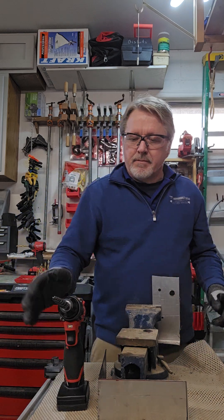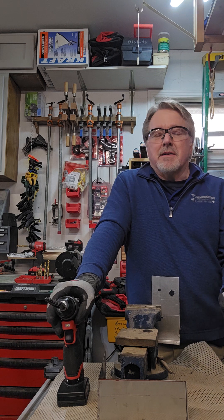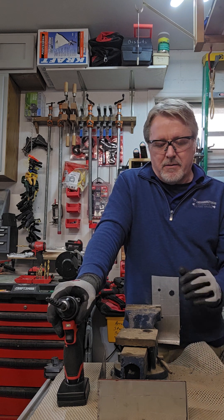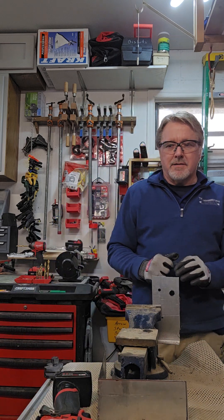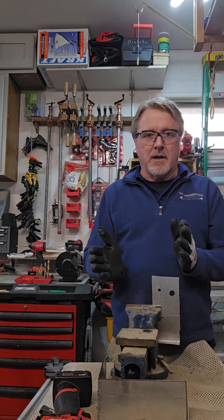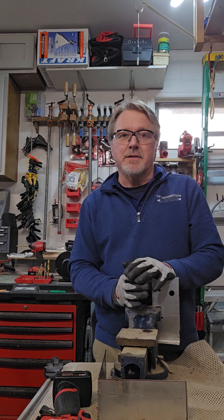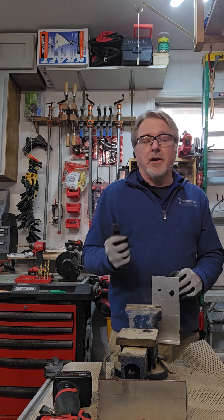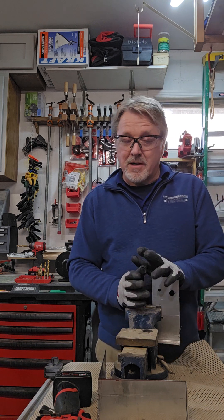The whole point of this video is that in any small shop you're always in a situation where you have a piece of metal and you need to enlarge a hole. Old school — like they taught me in high school metal class — is you drill a pilot hole and keep jumping up drill bits until you get the size you need. But over the years selling tools and speaking with drill bit and cutting tool manufacturers, they all strongly recommend that a drill bit was designed to cut from start to finish. If you want a three-quarter inch hole, grab a three-quarter inch drill bit — no pilot hole.